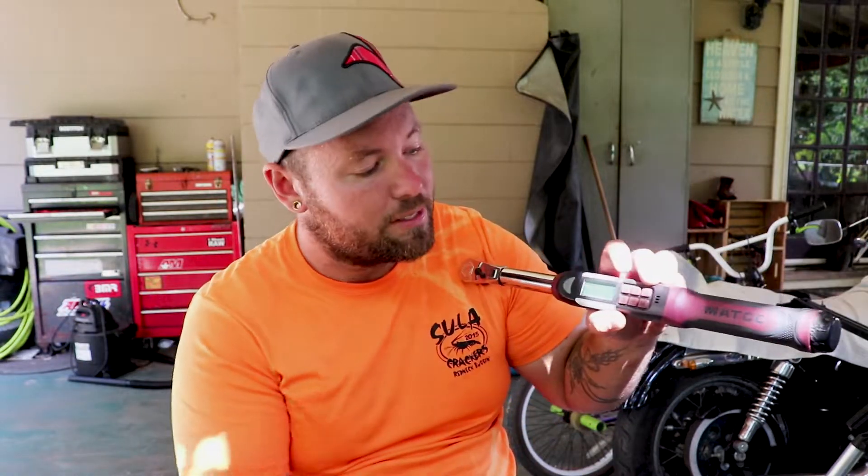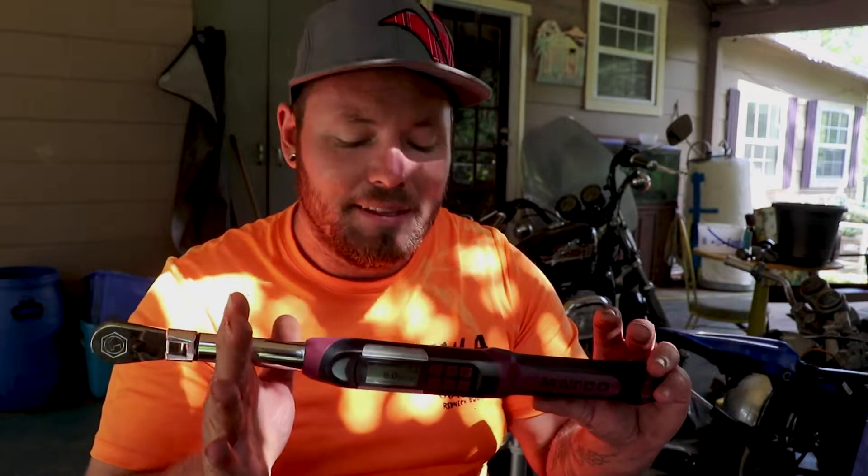You hit the on button and cycle through U for units, then go through and set other parameters. I'll have a link in the description to a full review and all the different functions and key features of this torque wrench. It's actually pretty simple to use, especially these digital ones. Mainly all torque wrenches are the same — the old-style click types are great, but this one vibrates, beeps, and lights up. That's how to use a digital torque wrench.